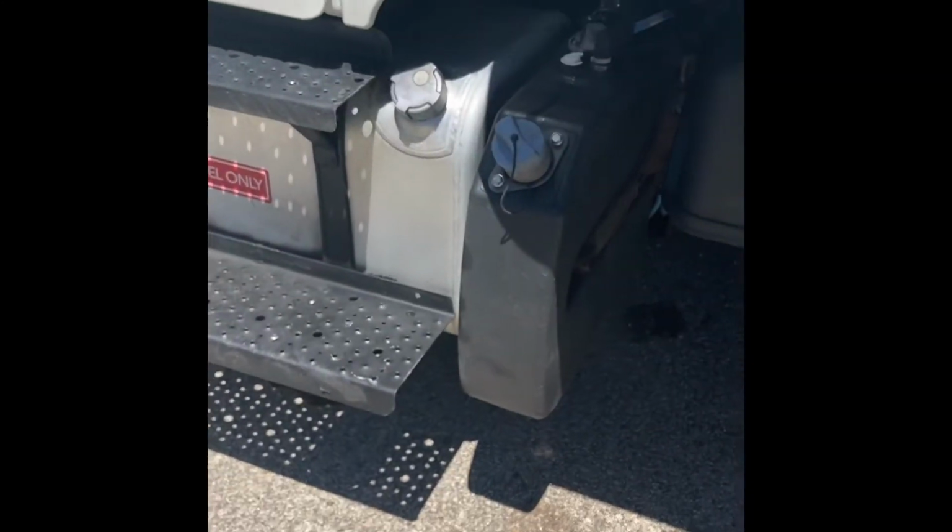And that serial number will tell you exactly what kind of transmission you have, 2500 series or whatnot. Because if you bought that truck used, you don't know what that truck's been through. You don't know what's been changed out. You don't know what's been added. So it's best just not to assume, just go ahead and check.